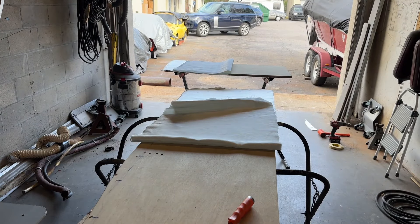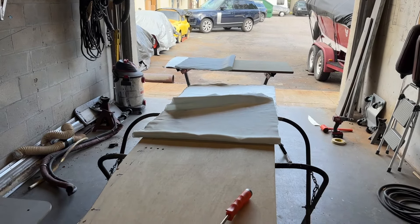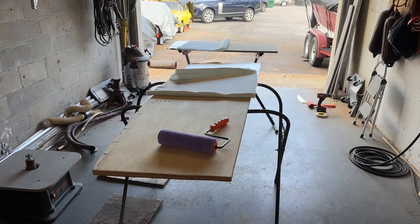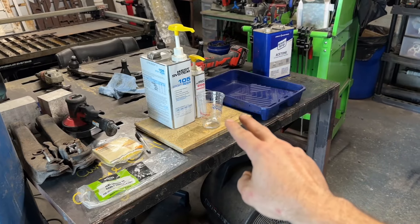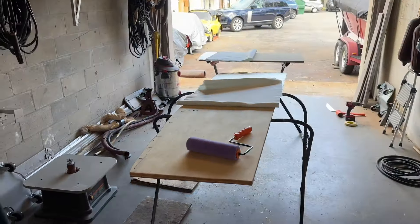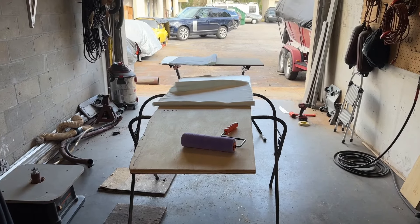I'm going to go ahead and list their channel below in the description because they've been just amazing helping me — on top of all of my friends' advice, it's just nice to see somebody who is a fourth-generation boat builder talk about how to do this stuff properly. So what I'm going to do is mix up some two-part epoxy resin from West Systems — that's just one-to-one. We'll probably do a 10 pump batch, mix it in the cup, pour it into my paint tray, and then we'll go ahead and wet in this board. I'll throw you guys on a time-lapse and we can do some fiberglass work.